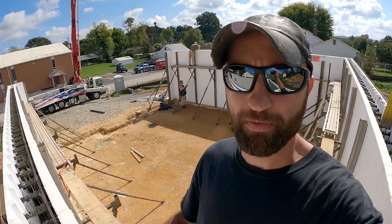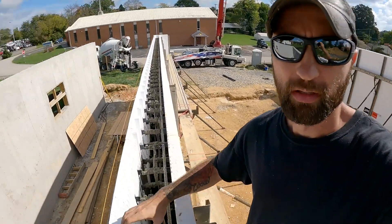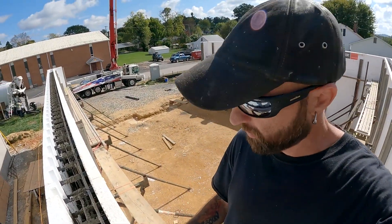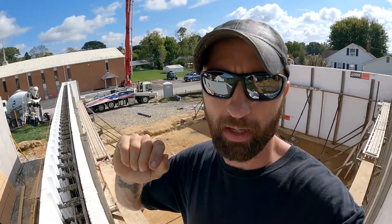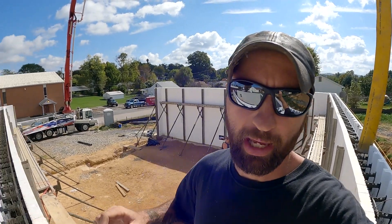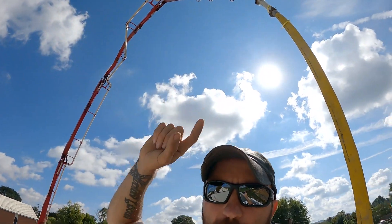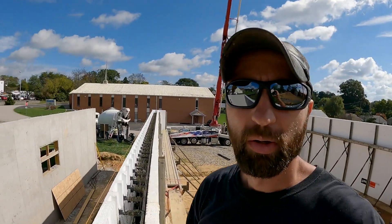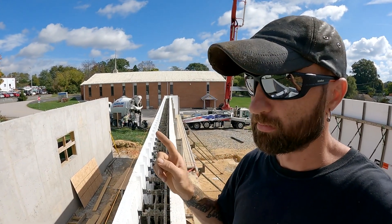After that, the last week or so I've been helping to build this ICF foundation — insulated concrete form. You can see the styrofoam has an eight-inch gap in between it. We put in rows of number five rebar, and today we're pouring it. We've got the pump truck, we've got the crane about 60 feet in the air. We're on our third concrete truck, waiting on the fourth one to show up, and we're gonna get this wrapped up today.